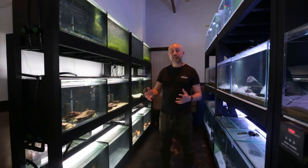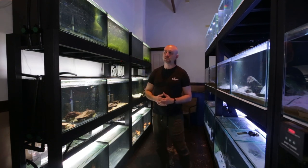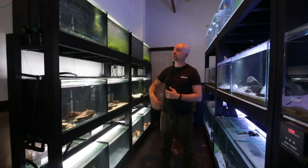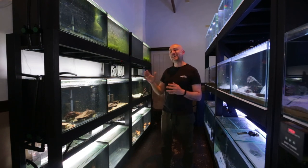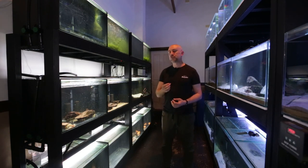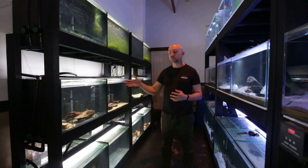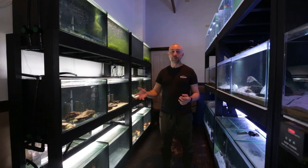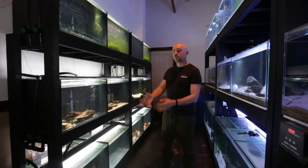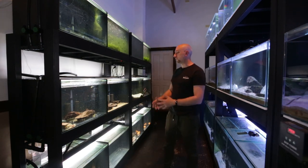After that I decided to drain the tanks and break the siphons. The reason I broke the siphons is because the tanks would just continue to drip — they'd continue to drain to the halfway point below where the drain lines are. If left for 24 to 48 hours, even with just a couple of drips per minute from a couple of joins, you'll eventually flood your fish room. Filters and heaters would run dry and get damaged. So I just decided to continue with the test and drain it all out into the garden until I broke all the siphons.